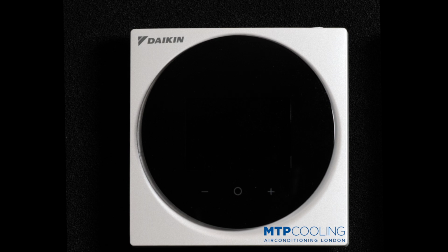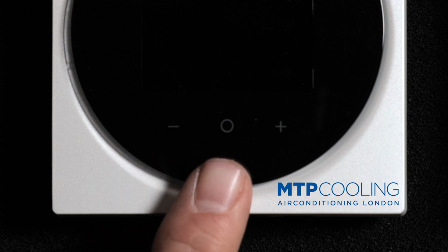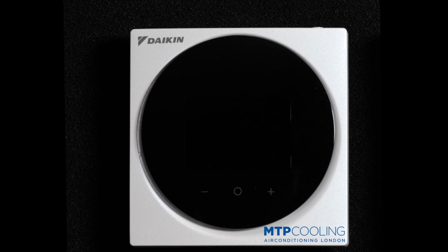This is a quick tutorial of how to use MADOKA controller. Let's start from the buttons. You've got 4 buttons, where the one at the bottom, that's the minus, middle button and the plus button. The middle one, you use that for entering the folders. The plus and minus is to navigate. And then on top, you have your on and off button.